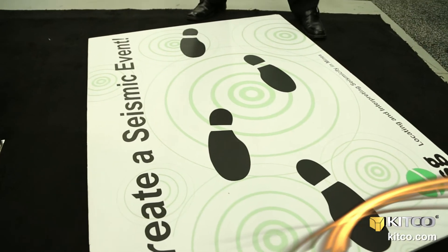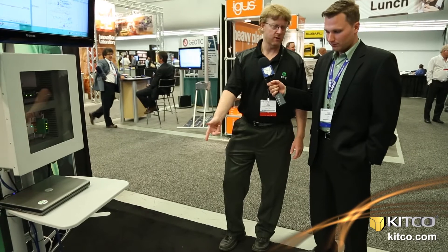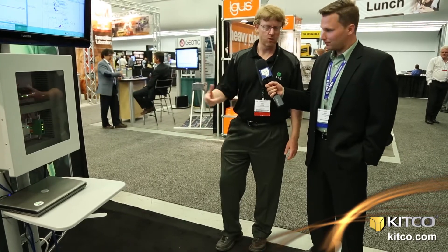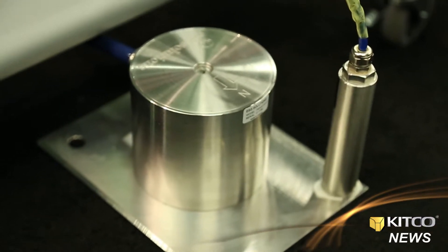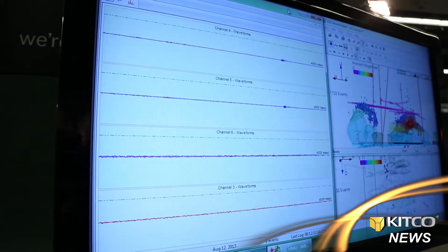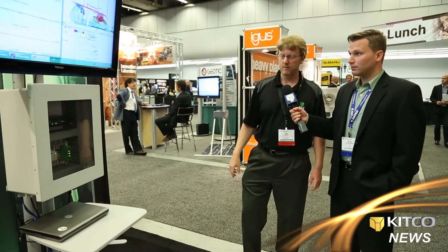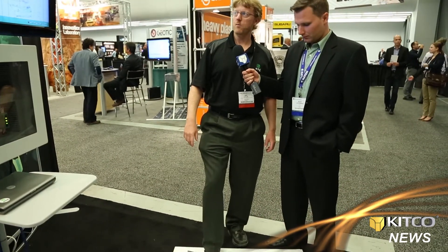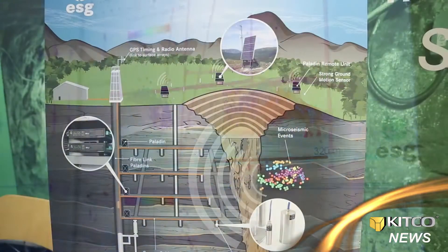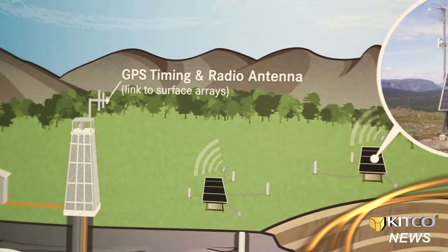So how about a little demonstration? Tell me what to do to make some seismic activity. We have a couple of sensors on the ground here. The large one is called a triaxial sensor — it gives a full 3D motion of the ground. The smaller one is just a single element geophone. On the screen, the top three blue lines are the triaxial sensor recording, and the bottom red line is the single sensor. If you start tapping on this board, you'll see we're generating waveforms that these sensors are picking up just from the vibrations in the floor — essentially like microphones underground, listening to the noises and then triangulating to get the event location.